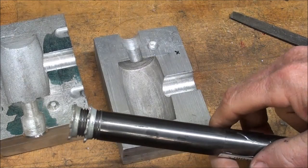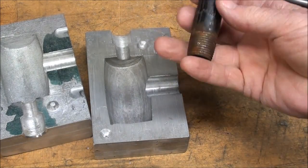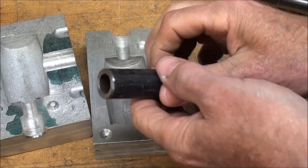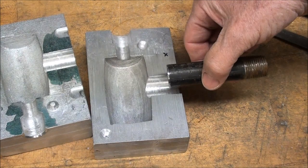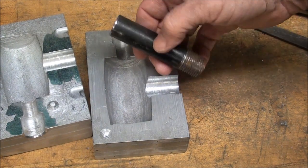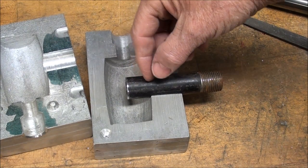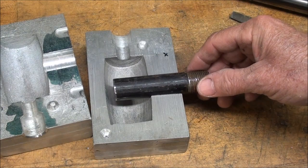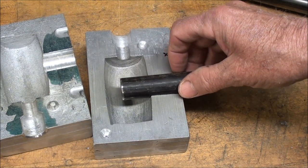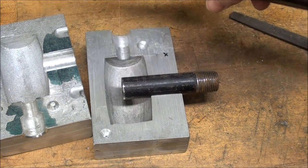Now back when I was teaching many years ago, I had a cast iron mold for this. What I would do is heat the end of the pipe red hot and pinch it in the vise. That would close it off and also keep the handle from pulling out. The problem with that is it also distorted the pipe a little bit farther back than where I pinched it, so sometimes the pipe would no longer fit in here — it would be too large, or I would have to shove it way up to overcome that distorted portion. So I'm not gonna do that — I'm gonna use sand like I just described. But you do have to have some kind of preventative measure from keeping the lead from escaping.